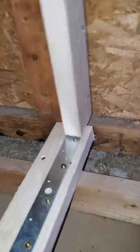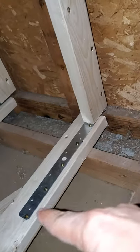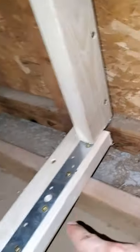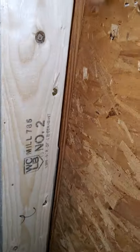Then I cut another two-by-four right here, and I got these truss wraps — these metal straps. This metal strap is screwed down to this two-by-four here, and then it is wrapped around the backside of this two-by-four here. As you can see the metal edge there, it's screwed in. For extra strength, I screwed this two-by-four to the original truss right there.